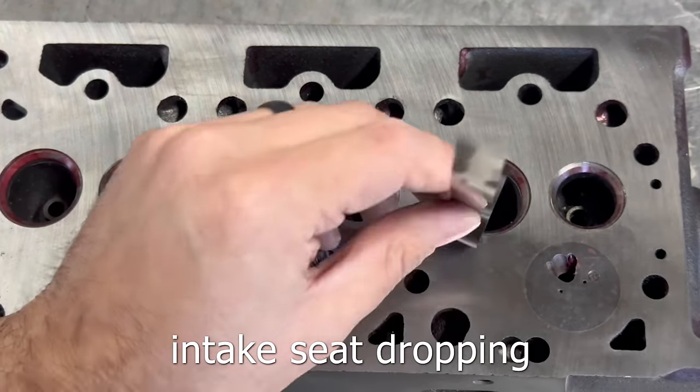However, we should all expect that the center cylinder is going to be the worst, considering the damage to the head, so the fate of this block hinges on that. There's a dark spot on the left side of the cylinder wall where the stones from the hone haven't touched yet, and the bore gauge confirmed what we're seeing is actually essentially a dent in the cylinder wall. The cylinder measures 4 or 5 thousandths big in that area. After cleaning the cylinder of all honing oil and making sure it's completely dry, we magnafluxed the block again to check for cracks in that location. Nothing appeared, but we are still concerned.